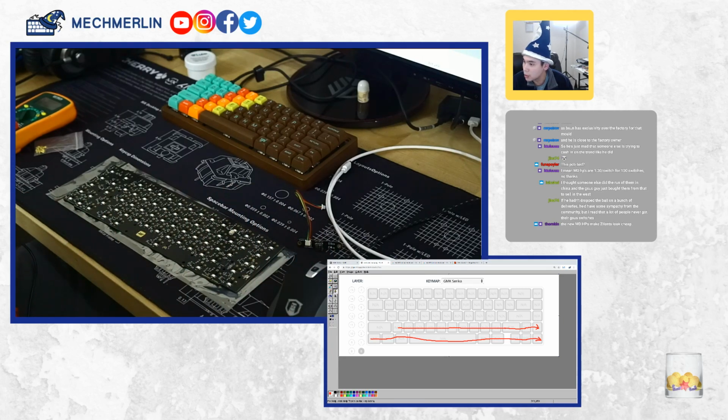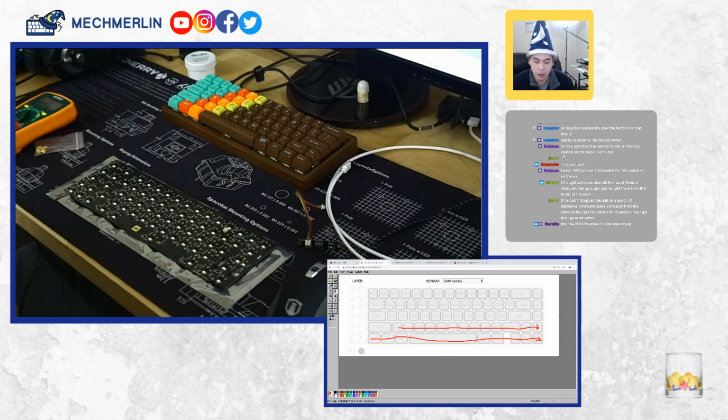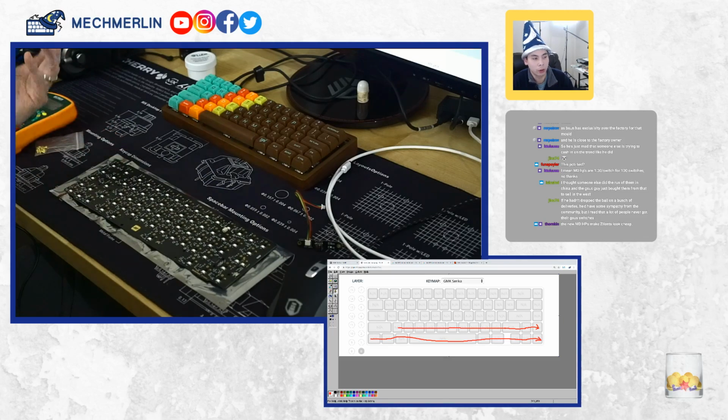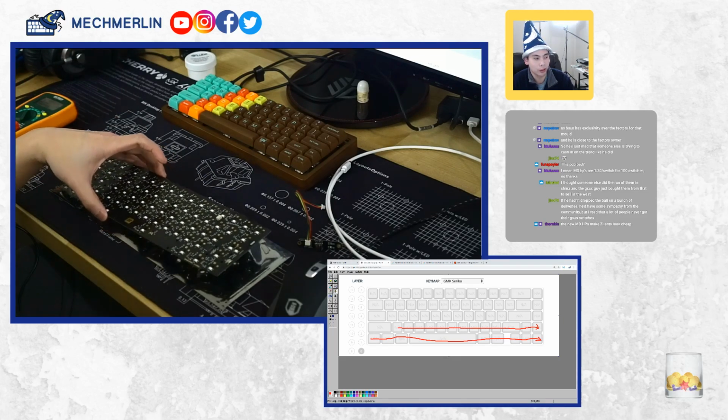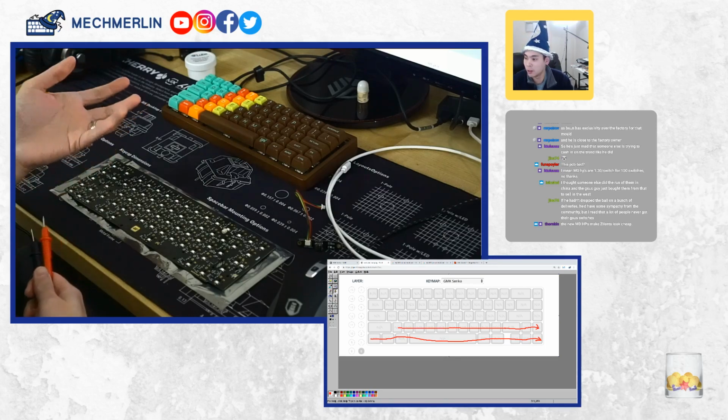Fun Spoiler says this PCB is bad. No, well, yes, this PCB is bad. It's defective, but that's not why I'm doing this. The Doro67 came with 3 PCB variants, a regular one with multiple layouts, and one with RGB underglow support, which this one is. Unfortunately, the firmware doesn't exactly control RGB underglow, so I'm implementing the support for it.